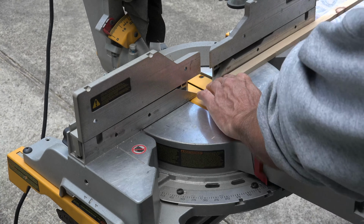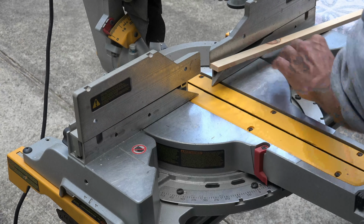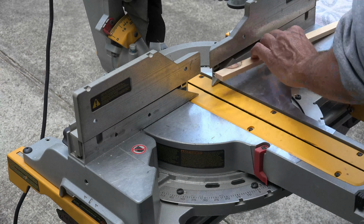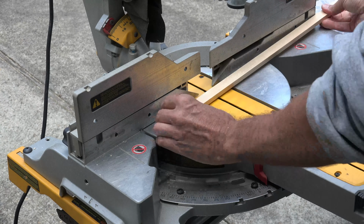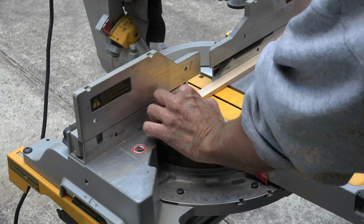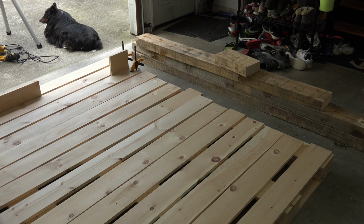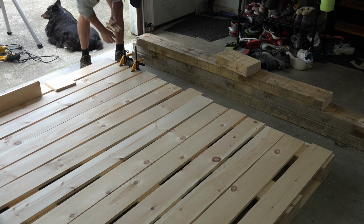Earlier, I told you to keep the strip from the 1x8 because it will come in handy. Well, grab that now and cut around 4-inch pieces. No measuring here, these are all just spacers to help align the base pieces. Cut your strip until you have a stack of pieces. Take those pieces and place them between your slats. This will ensure all your boards are evenly spaced.